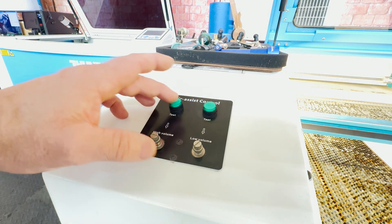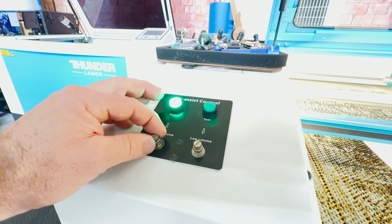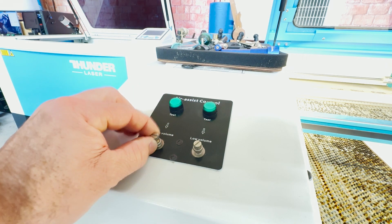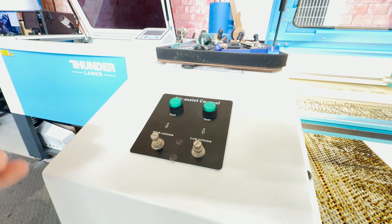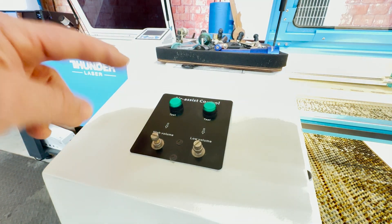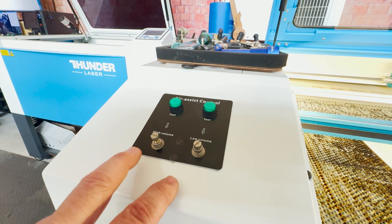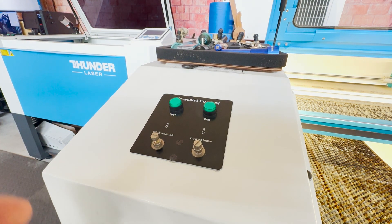Even though it's rated for about 55 PSI, the hoses and things like that will not allow for that high volume of air to flow, so it's kind of defeating the purpose. I run right around 30 PSI, and if I hit my high volume air, you can hear it blowing out a lot of air. If I turn it down a little bit, this is how I'm going to adjust it. We do have a locking nut — if you're doing the same things constantly and you know where your air needs to be, you can always lock it down. Personally, I don't do that because I always forget to send the correct version over in Lightburn. So I can quickly manipulate it if I send it over in low volume but I'm trying to cut.